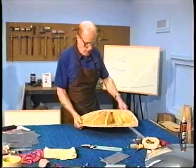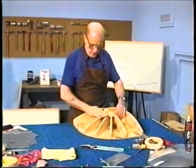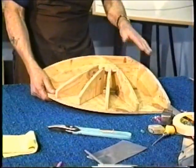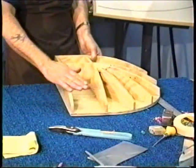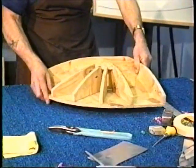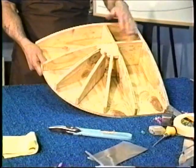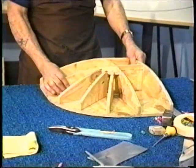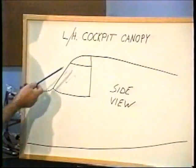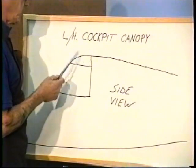We have another unique panel to discuss right now. This is a unique little buck — we call it the cockpit canopy. The features on this buck are: we have a lot of shape in this area which is about a quarter of the buck. The side pieces are flat across, although they have shape here. We have the same situation here — we're flat across but we have a crown here. All the work will be done in this area and we just tail out to the edges. A flat area is very difficult, but you can put all the shape in here — you do have to wheel out to the edges of the panel. Here is the position for the application for that panel, the cockpit canopy. It's symmetrical so it will do for the right hand and the left hand.